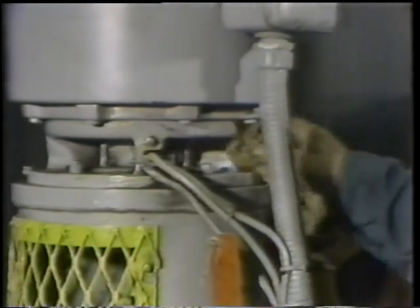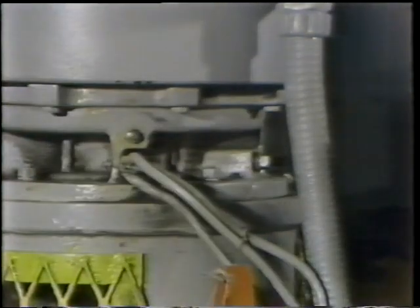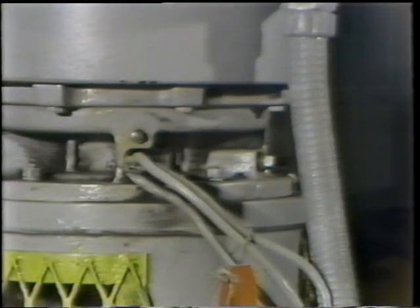After the plug is completely tightened, the worker makes one final check and wipes away any remaining grease residue. This is done to make sure that grit doesn't get mixed up with the grease and accidentally get pumped into the lubrication system. That's one typical example of a grease lubricated bearing.